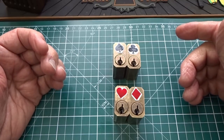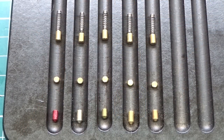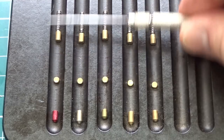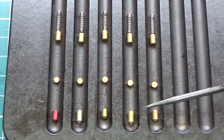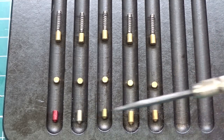We need to talk about master keying and how exactly that works. This is what the guts of a typical master key lock would look like — a five-pinner. What happens above the shear line with the drivers and springs is identical across locks, so we can ignore that. The important part is down in the key pins, and you can see there's a little variation in the pins.